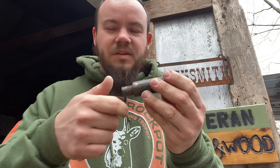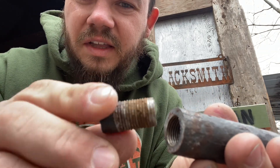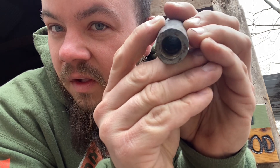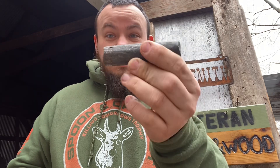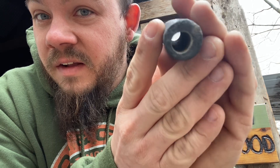This one is probably a 1-in-3 twist. I didn't fit the breech plugs at all on either barrel, and this one has some more rust in there, probably from gas blow-by. I didn't completely drill out this one either. If you remember from the test video, I was taking a metal rod and a hammer and beating lead down into here, mushrooming it into all those tight coils. The pressure spike on this one must have been intense — it had to shear the lead to push it out of those coils.